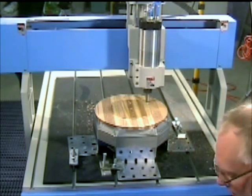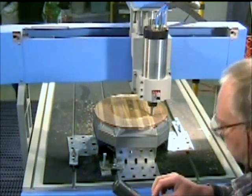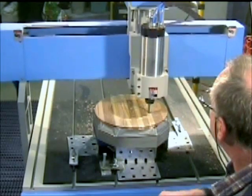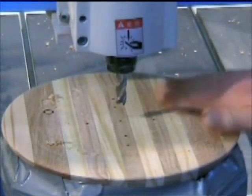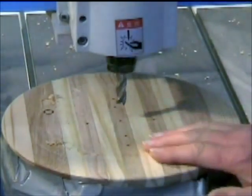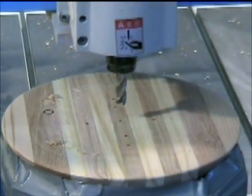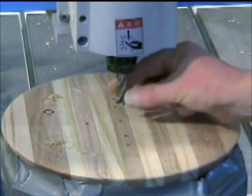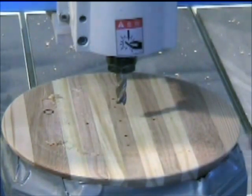The trick is a little bit at a time. I've just taken off that bit of a boss there. You can probably see this isn't exactly square — there's probably half a mil difference on this side. It really doesn't matter; I'm just going to scallop the inside out anyway. I've loaded the G-code for the roughing operation. This is a 12mm three-fluted end mill — that should do the job nicely.